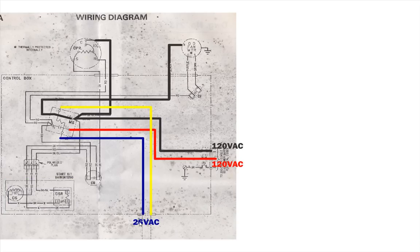When 26 volts AC energizes this circuit, the contactor closes and energizes the capacitor, the common on the fan motor, and the compressor on the run terminal. The capacitors themselves then complete the circuit and kick start both the fan and the compressor. That's basically how you review the wiring diagram of your condensing unit — it's very useful when troubleshooting where all the components are and where all the wiring goes.